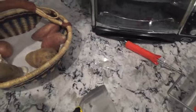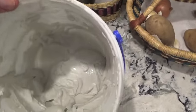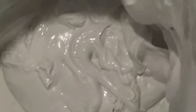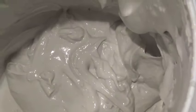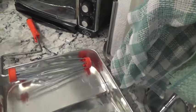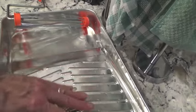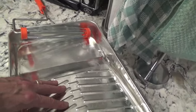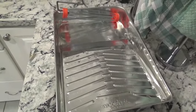What I do is I mix up the plaster so that it's not solid like it originally comes out — it's more of a soup by adding a little bit of water to it so that it's not real dry and solid. I basically put a bunch of it in the bottom of the pan, add a little water, and then mix it up with the plastic putty knife, plaster knife, until it's the right consistency. And then using the roller I sort of roll it out onto the surface and keep rolling it until I've got a coating on the texturing roller, and then apply it directly to the ceiling until I get a somewhat even effect that I want.